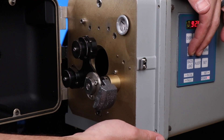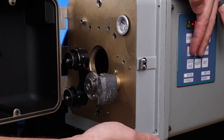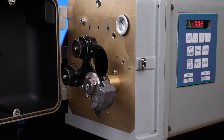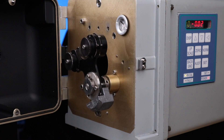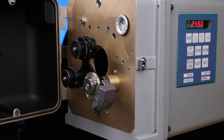Initiate the cal by pressing upscale and zero buttons together, then letting go. Watch for the in cal button to illuminate. The cal takes approximately four minutes. Notice the calibration mechanism lowers to check the zero, rises to check the span, and then returns to normal position once the check is complete. After two calibration cycles have been performed, the set procedure is complete.